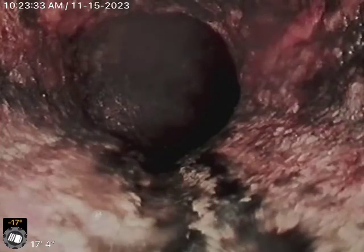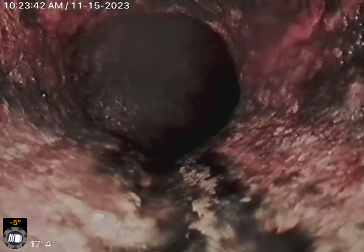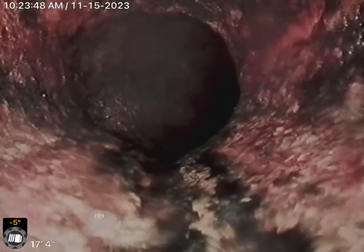The black, kind of slimy material you'll see on the sides and bottom of the pipe — that's what we call sludge buildup and grease buildup. Now, when I say grease buildup, I'm not pertaining to cooking oils or things like that. What happens is cast iron just starts deteriorating on itself, and as it's deteriorating with water sitting on it, this is kind of the material that we're left with.